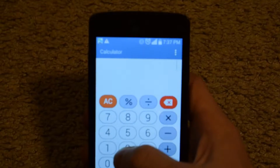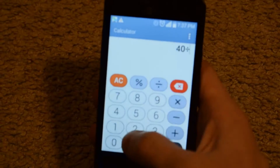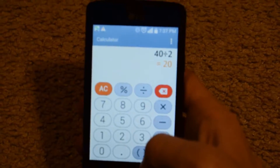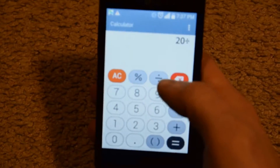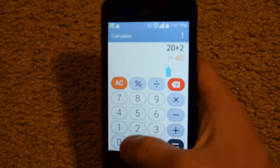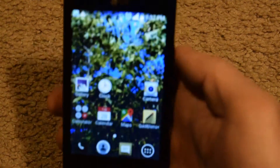So that's about 40 weeks — 20 cycles times 2 weeks — which is a little under a year of running. And I will have a battery that is fully restored, or about fully restored. I hope you enjoyed this video and learned something about desulfators and how long they actually take to work.